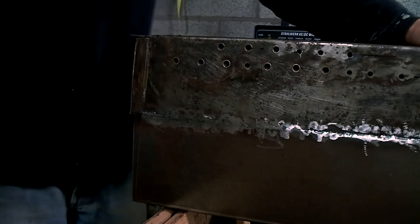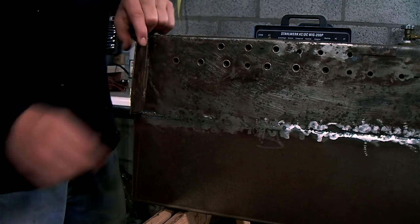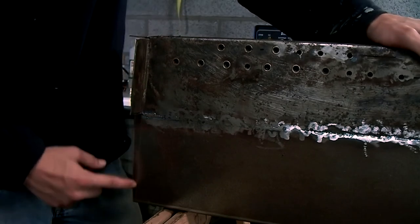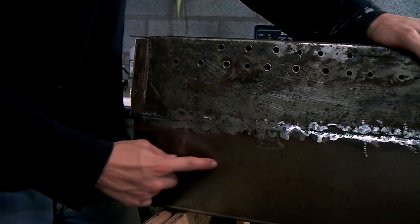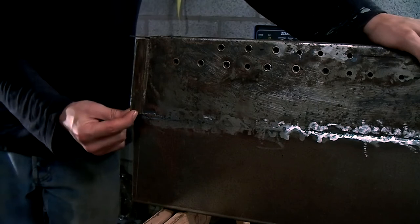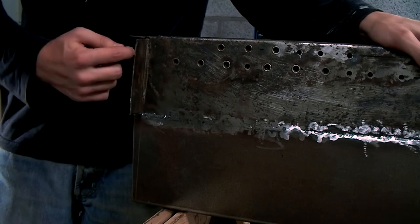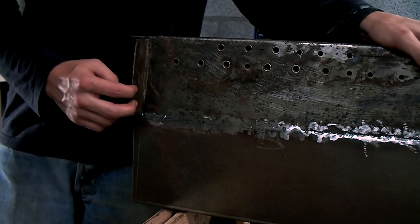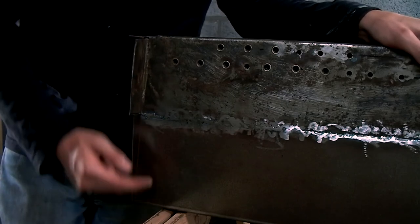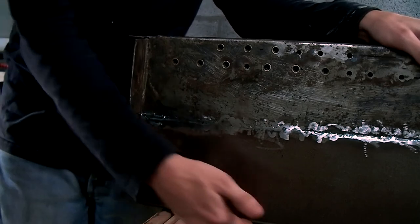Among the smaller jobs that still need to be done before the backbone is completely finished is removing these flanges. There's one on this side and one on the other side. We removed this part of the flange when we cut out the rust piece of the chassis. This was the original way to mount the front T-section to the backbone, and it would have just been welded along this edge to the T-section, but it wasn't an efficient way because there are a lot of chassis that are cracked along the bottom here, but Series 1 chassis don't have that because there's a strengthening plate on the bottom.